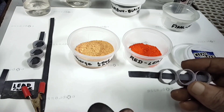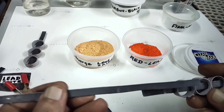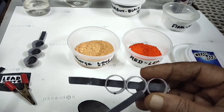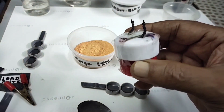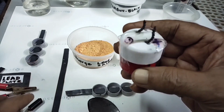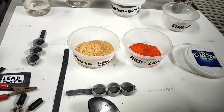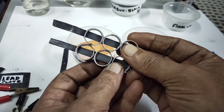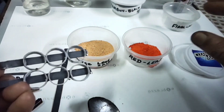This will be the structure — PVC tubes cut using a hot flame, then I pierce the plate. The big lead plate is available, so we buy it and make a strip like this, insert it, and cut it to whatever size you want. You can use four rings, two rings, or a single ring. This battery was prepared using a single ring — it gives 2.1 volts and 1.8 amperes. For more ampere-hours you can use three or four rings, even in parallel, to make bigger cells.